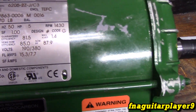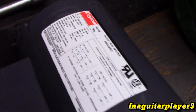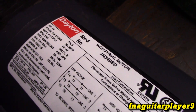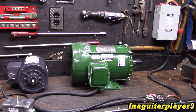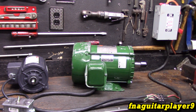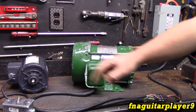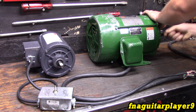Just to confirm for anyone doubting it - these are three-phase motors. Here's the three-phase nameplate on this one, and there's the model number if you want to look it up. This half horsepower motor is a good little motor to mess around with; it can be wired up for 240 or 480 volts. Right now before doing anything we'll turn it on - you can see I've marked the shafts so you can tell when they're spinning. Right now they're both just going to sit and hum, and if you left them they'd blow a fuse or burn up.